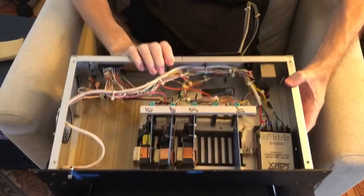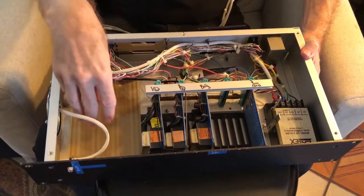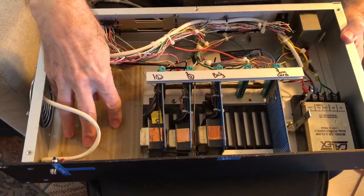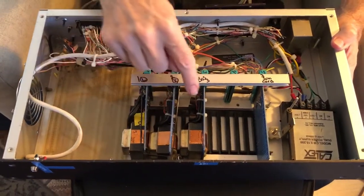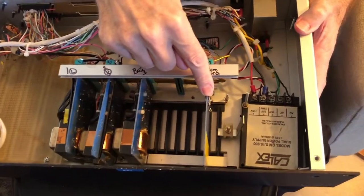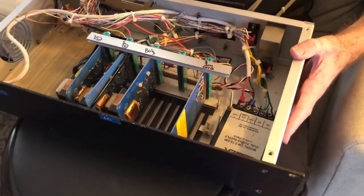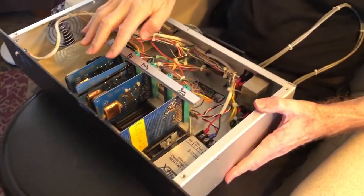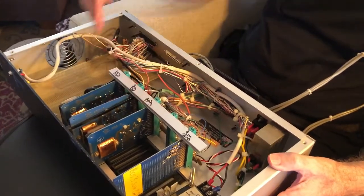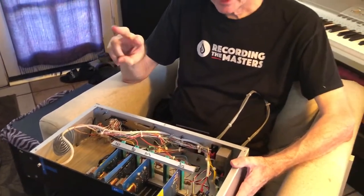Here are the cards mounted inside, and this is the circuit board that handles the summing resistors. On this small circuit board we have the summing resistors that handle bus number three — those extra six inputs for doing up to six microphones — and then we have a bunch of inputs coming in on D-subs that are coming out of the interface, probably a Digi interface, out to stereo.